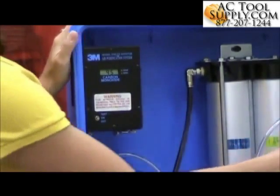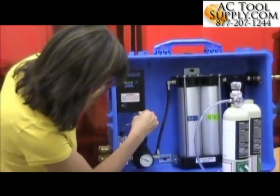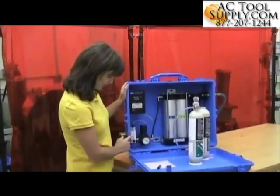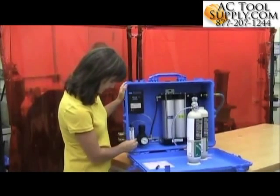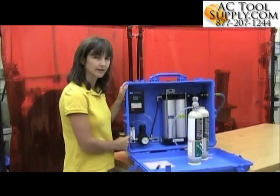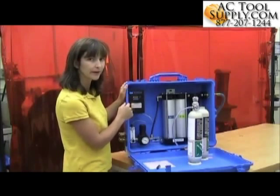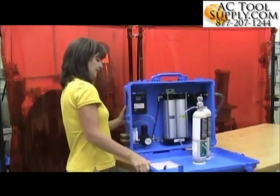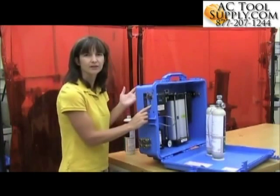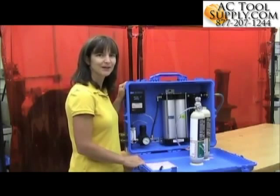I'm going to take my gas off, turn it off, and reconnect it to my supplied air system. Make sure that the flow of gas is adjusted so that I'm in the center of the green rectangle. And I'm almost down to below 10 parts per million, and my alarm turns off. I should see on the right side of the panel that I'm in normal operating state — the green light's on. So my monitor is functioning properly, and I'm all calibrated and good to go.